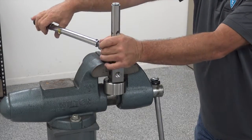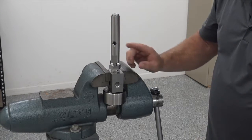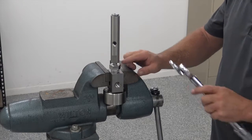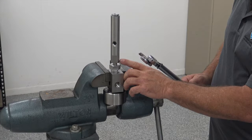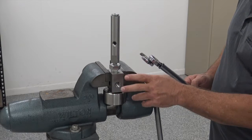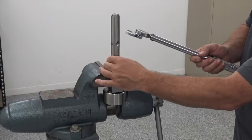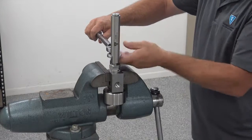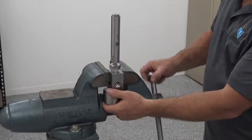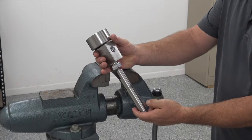Stabilize the assembly with your left hand until you hear the snap. Now we're going to tighten the catcher tube assembly onto the nozzle tube. Remember, there's an orifice in there and there is a specific torque rating. Today I'm using a crow's foot — this particular one will tighten at 10 foot-pounds. Check your manual for yours. If you're using an abrasive body or some other application for this normally open valve, check your manual for the torque rating on whatever orifice you have. 10 pounds isn't much so you probably won't hear much of a snap. After you've got everything tightened and torqued into place, your valve is ready to be put back on your machine and your repair is complete. Thank you for watching.